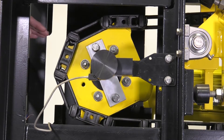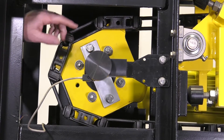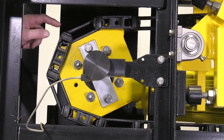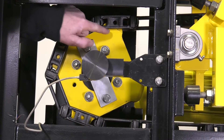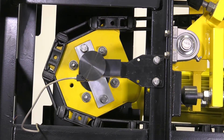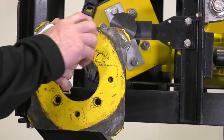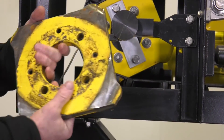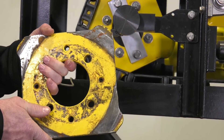It's also really important to inspect the exit side of the conveyor on the sprocket. This same sprocket is used for both the RG440 and XR1000 conveyors and is a wear point, so it needs to be inspected. You want to make sure the tooth doesn't wear down too far. As it wears, you can see the chain wears off one side of the tooth — it can actually be turned to extend its life. But when it starts to flatten out on both sides, it's time to replace the sprocket.